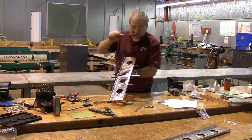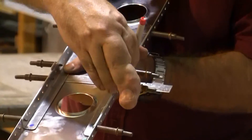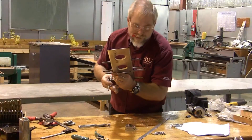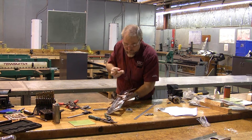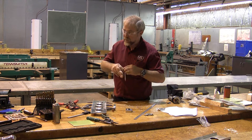To mark the sight line, we're going to sight right down this edge, right here. Now when I look straight down that edge, I can see just a little bit of my sight line, and that is exactly where I'm going to make this bend — exactly where I see that sight line that I just marked.